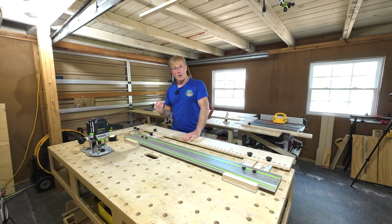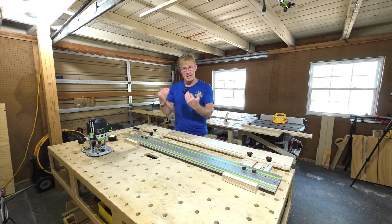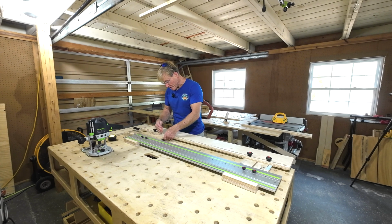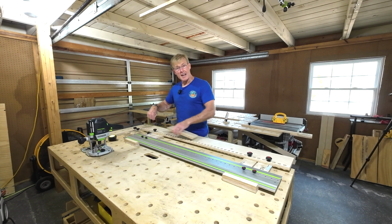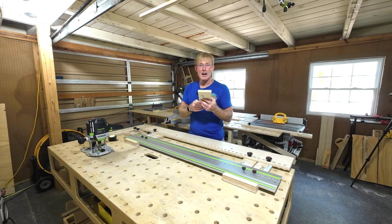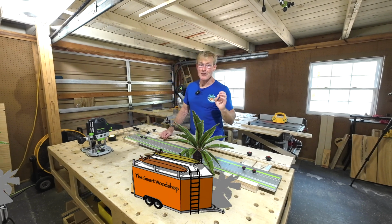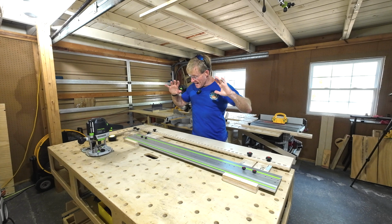And then if you're off, if you've got to go a little bit longer, then just use a feeler gauge and figure out exactly what you need to go. And by loosening this up, if it needs to go wider, then you just put a feeler gauge in and move it out that little bit on both sides. Reclamp it, double check it with your feeler gauge. And if you need to go closer, then run this through the table saw, that small amount, and then test it and make sure that you've reduced it by the amount that you're off. Again, we're talking about 1/10 of a millimeter here. And you get that in, and then it's going to be, again, set it and forget it.